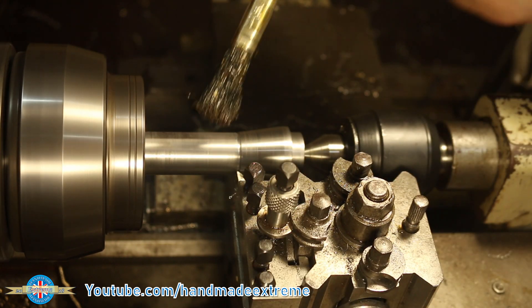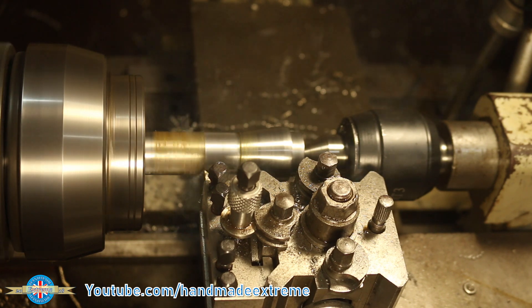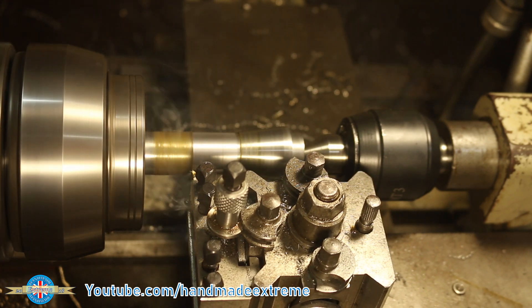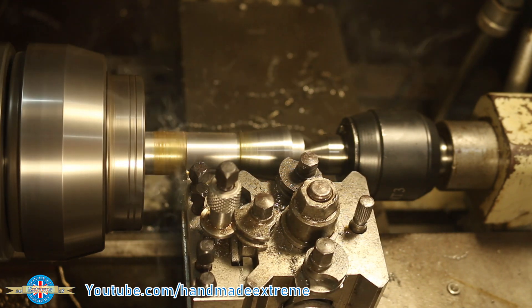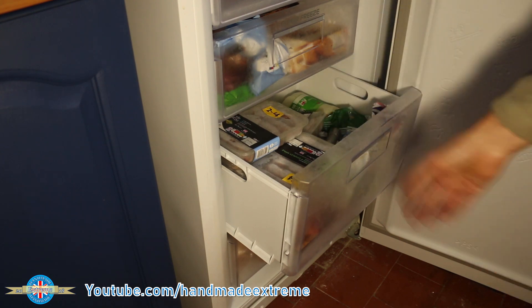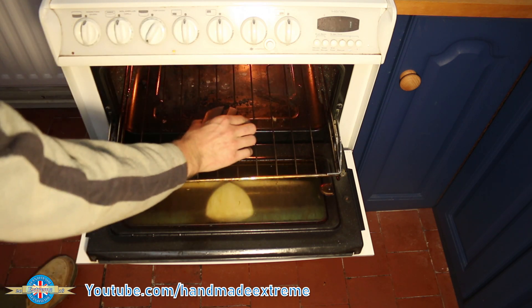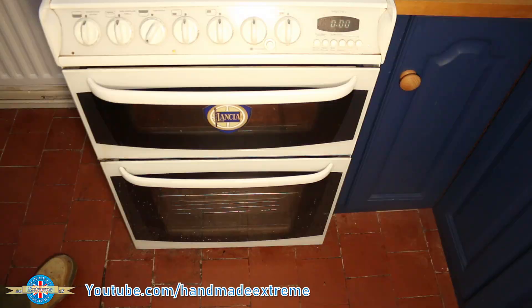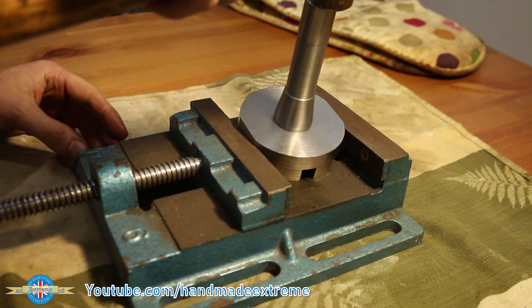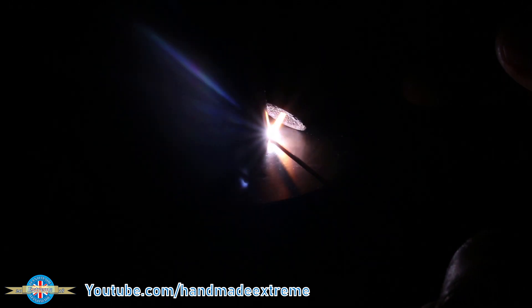With the disaster avoided, I could make a relief cut along the straight section of the adapter. This just provides some clearance when you put the adapter up into the spindle of the milling machine. Cool that one down, warm that one up, and put the two together — and maybe just a quick insurance weld, just to be sure.